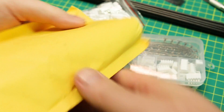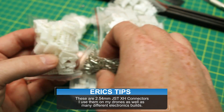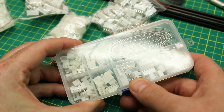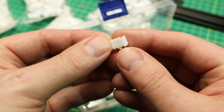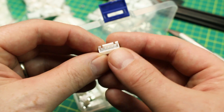Next up, for various RC and electronics uses, I got all kinds of connectors — bulk ordered in one package and a nice kit in another. These are the same connectors we use for balance leads, so we can repair balance leads as well as use the male side for PCB connections. Inside the kit we get various connectors that can go right onto my custom-made PCBs for robotics projects, making a nice turnkey solution for plugging stuff in and out of circuit boards.